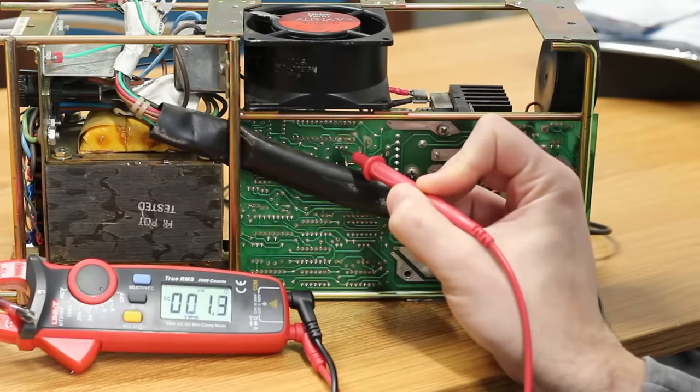I don't know how to use ODT, so instead we'll flip the halt switch off and hit restart. KDF11-B, ROM version 0.9, error 1: no memory, error 6, trap 10, error 10, 173414. Looks like it's not detecting our 256K of memory. That could be a fault on the memory card, or it could be that the CPU has a jumper set to look for a different type of memory — maybe 22-bit 4-megabyte memory or something like that. I need to dig back through the manual before we can break that error 1. I have no idea what error 6 trap 10 is either.